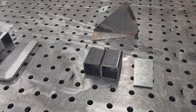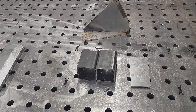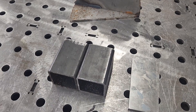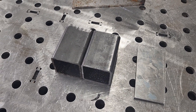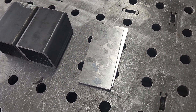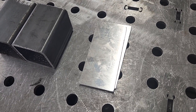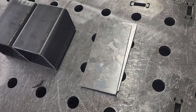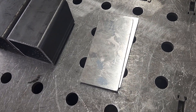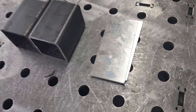Here's some material I gathered and made into coupons for today's video. On the right side we have our dirty material. I didn't do any cleaning prep-wise. The only thing I did was clean up the edges and get rid of any burrs. The aluminum we have here is just some eighth-inch coupons I cut from some material we had sitting outside in the scrap bin. It's pretty water-soaked because we've been getting a lot of rain. You can also see how grimy it is, and you can see a little bit of oil on it.